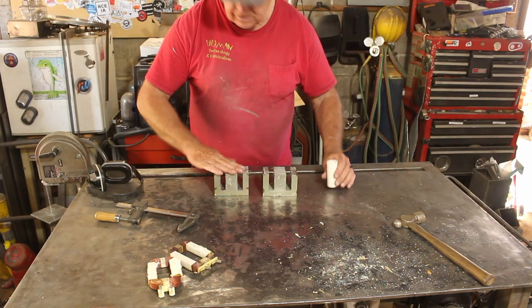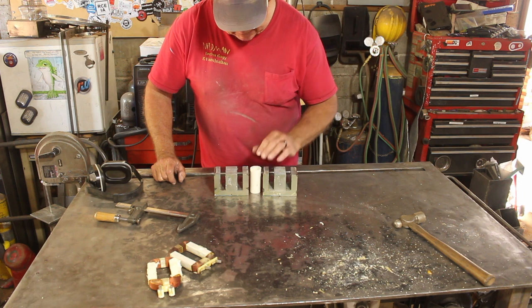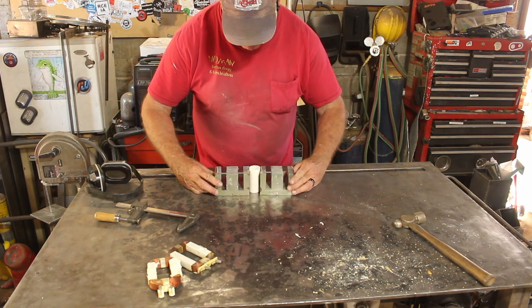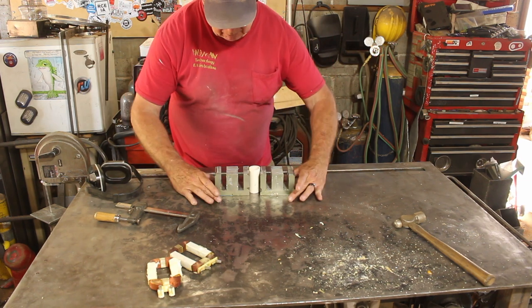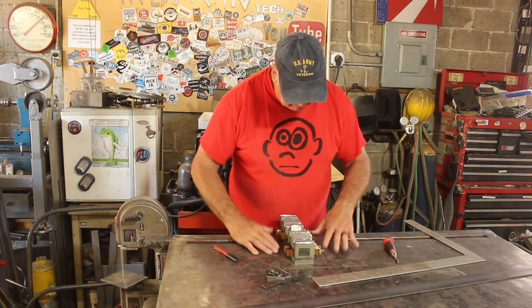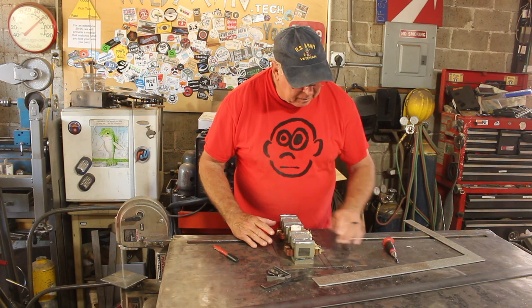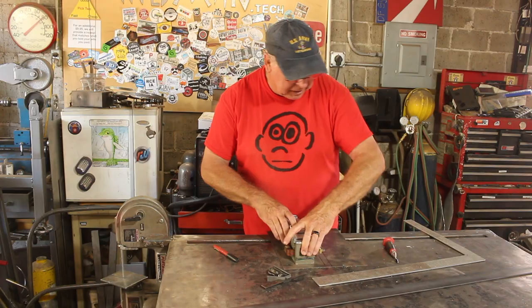I can plug that into the electromagnetic table. This is going to go on top of the drill press table. We want to place where the drill bit can pass through — that's just going to be this plastic tube right there — and we'll build a frame around it. I've got this piece of sheet metal with an outline laid out; we'll cut that out and use this two-inch strap to make a wall around it and weld it all together.